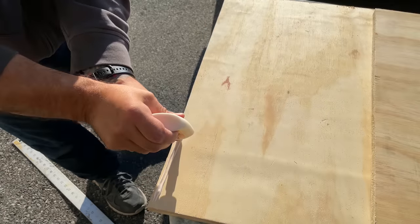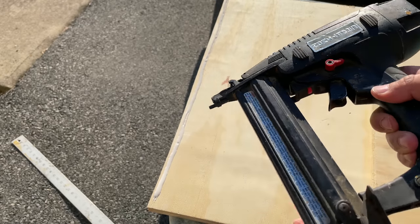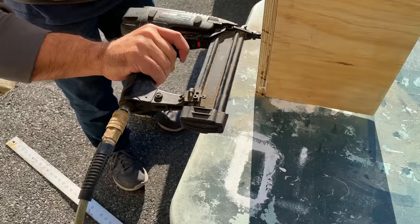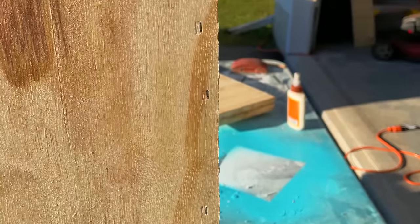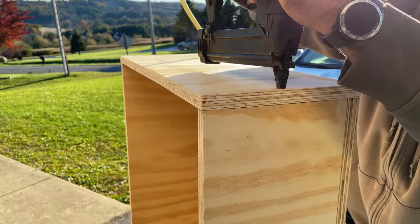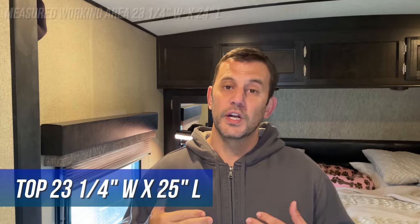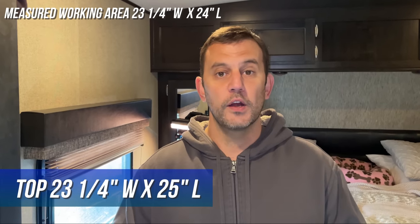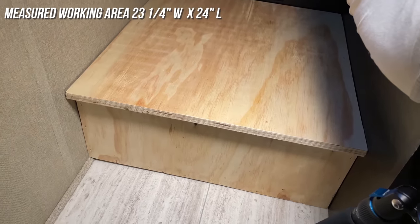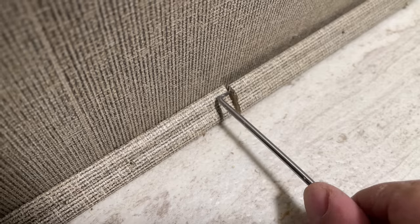I'm going to put wood glue on every edge that touches another piece of wood, and I'm using a one and a quarter inch narrow crown staple with a pneumatic staple gun. When you put the staples in, you want to put them in the direction of the edge of the wood you're going into so it doesn't split the wood. If you don't have a staple gun, you can use nails or wood screws, but anytime you're using wood screws near the edge of a piece of wood, I'd recommend drilling pilot holes first. The top piece is 23 and a quarter inches wide but 25 inches long — 24 inches plus three-quarters of an inch to square up with the front fascia, plus an extra inch for a lip to grab and pull up on. Now I'm just going to put everything back in and test fit it. If you have a trim piece, you can score it with a razor knife, pull the box back up, and pull that piece out.